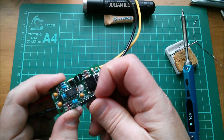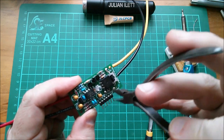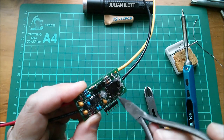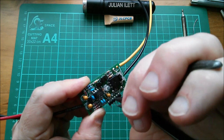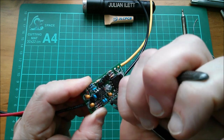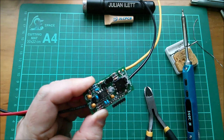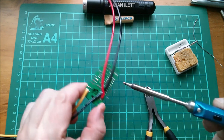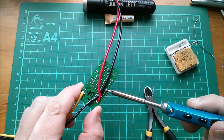I don't think I'm going to change the code in the microcontroller, so I'm going to remove this programming header now. As many of you said, I can always just put a header in and hold it tightly while I reprogram it - the reprogramming only takes a few seconds. The plastic is off now; let's get these pins out by heating them one by one and hoping they just fall out. I just bang it - yeah, that's worked, they're dropping out.